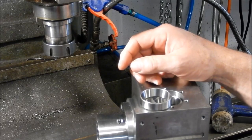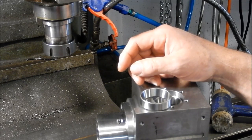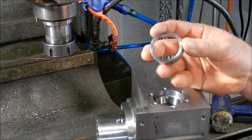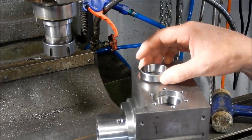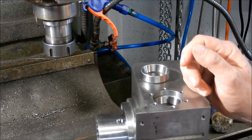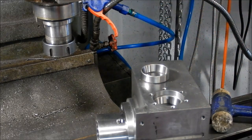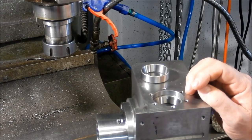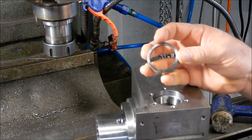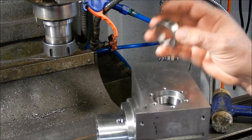At a big facility with an ER department, there were literally hundreds of CO2 bottles that they had on standby, plus the big ones you'd wheel in on the trolleys. We'd line up a heap of them and give them a blast and shrink them into place. It was often a lot easier to do that on gear. If you could do it in situ, sometimes you might have had days of work to get gear pulled out that may have been above it. It was much easier to do that sort of stuff in situ, a lot quicker. So CO2 bottles and a lined bucket, and away you go.